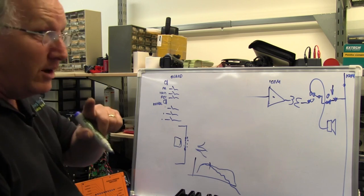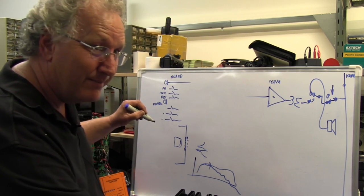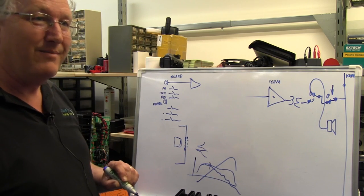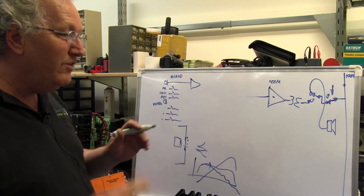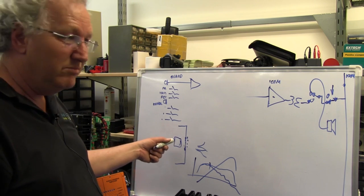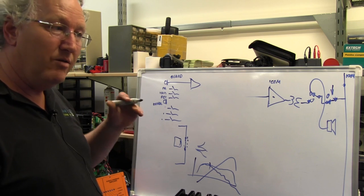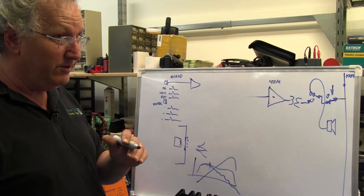They could. And you'd hear that, but then you'd get, next stop Central, all stations to whoop whoop. Just so. This is why the internal preamps down here have a shaped response with a frequency response like that to correct for the deficits here. So in principle, as long as the person speaking is within about 200 millimetres of their panel, you should be perfectly capable of getting quite good enunciation and clarity over the PA speakers.